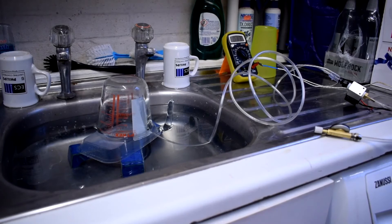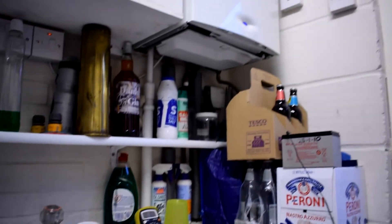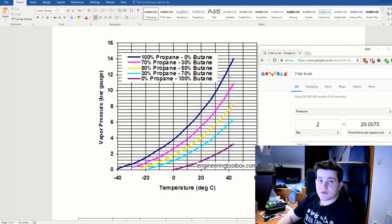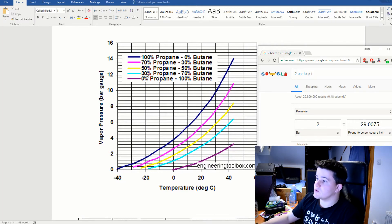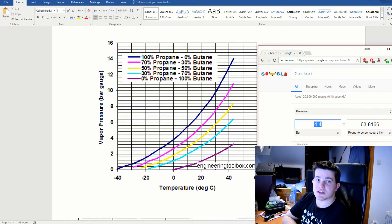If you're going to do these experiments yourself, it's not hugely risky — just be sensible, do it in an open, well-ventilated space away from sources of ignition and not with a boiler directly above you. When checking the pressure of the butane cylinder at about 30°C, we're reading about 32 PSI. Looking at the engineering toolbox chart, at 30°C you should have about 2 bar, which is about 29 PSI — so we're not that far off. For the 30% propane / 70% butane at 30°C we're seeing about 46 PSI, which should be about 4 bar or roughly 63 PSI. Maybe the cheapest pressure gauge on eBay wasn't the most accurate one.